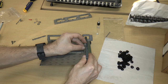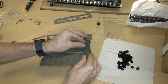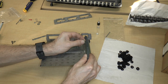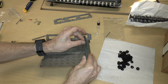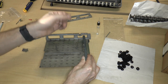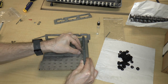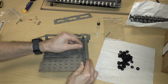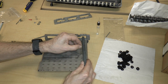In order to clear all the keys, basically what you would have to do is have a bar running the full length, pushing all of these rock bars like this, whereupon this can spring back up. And then you release it and it just goes like that, and then you can press this down again like that. So that's basically how the keyboard works. Here's the spring that goes onto the key stem that forces it up when the bar is released, and then it springs back up. So that's basically how it works.